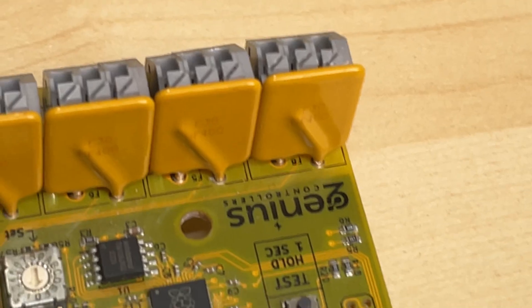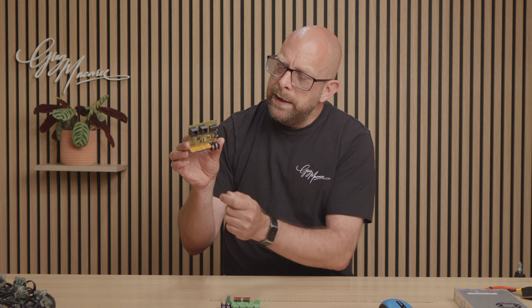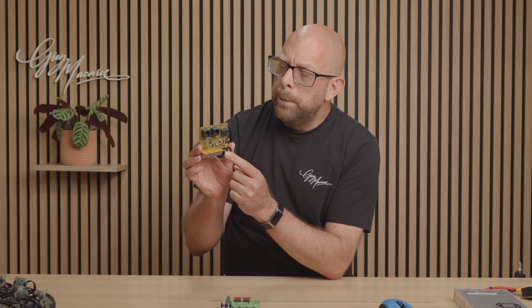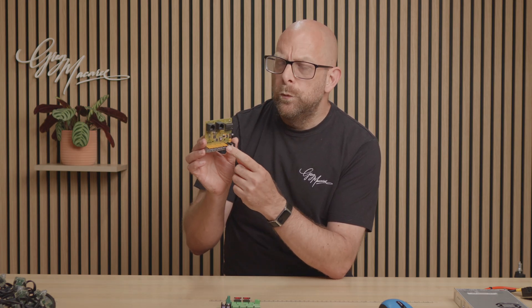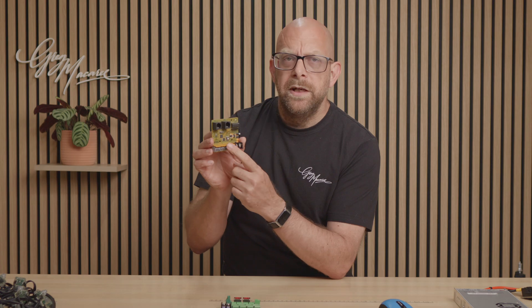The most basic of these e-fuses is called a poly fuse or poly switch. These are seen in some of the Genius boards such as this Genius GR4 receiver - we can see four poly fuses here. They will trip if there's too great a load; these ones are rated at about four amps continuous, probably push that to five, but much more than that and they will trip. Fix the problem and the fuse will, after a small period of time, reset and re-enable the output. So if you're putting a controller box up out of the way, you don't need to get up there with a pair of pliers and pull the fuse - these will just reset themselves.